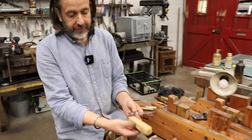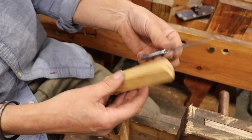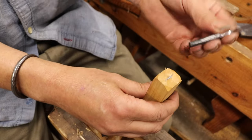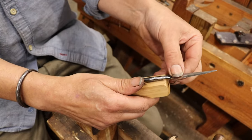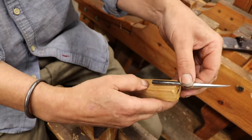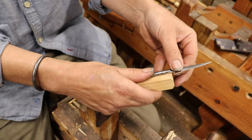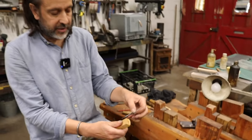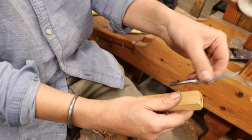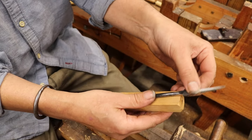For the handling process, we're starting with a billet in square section, close to the dimensions I want. There are two ways you can start. It's an easy blade to handle because it's a round tang — you drill a hole the right size and glue it in. What I wouldn't recommend is drilling the hole first and then trying to shape it, because you'll cut yourself or damage the knife. I'm relatively confident my self-centering vice will drill straight enough, so I'm going to shape the handle first and then drill a hole to suit.